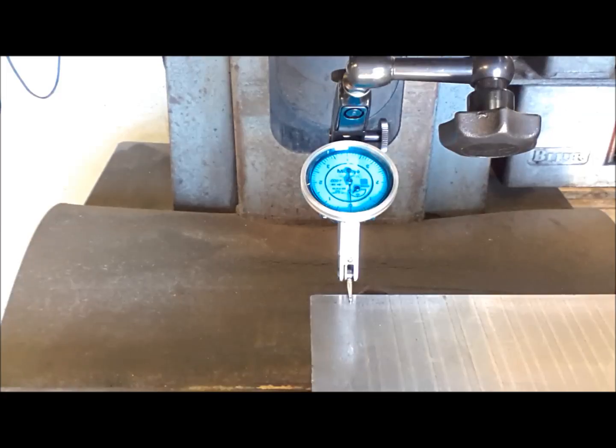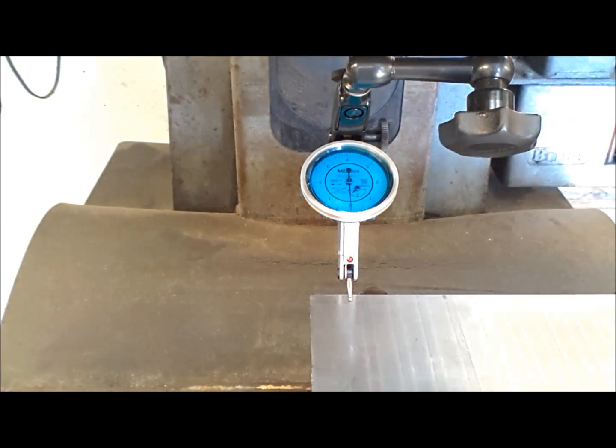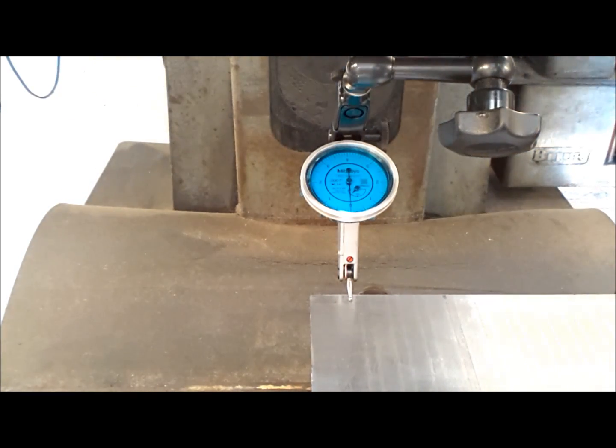I've reseated the mag. I had the back fence on and ran it side to side and got the mag squared with the table. Now that we're all reseated and bolted back down, everything's stoned down, I've got a clean surface to mount on. I'm going to get some readings on the top and I'm sure it's going to be a whole new ball game now, because of the corrosion and the stoning and everything I did to get that magnet to sit flat.